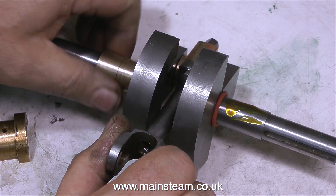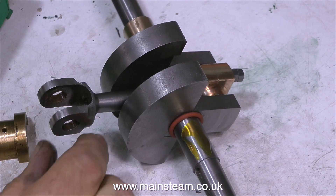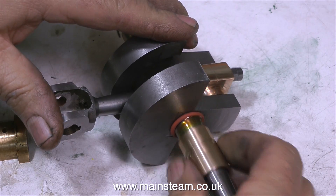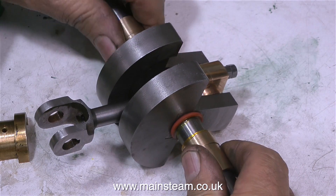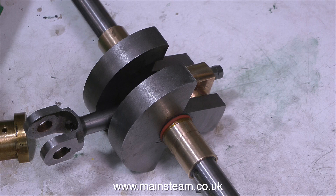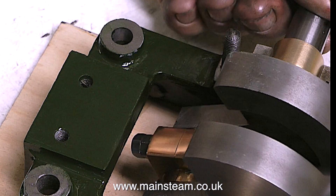I'm just checking the fit of these bushes on the crankshaft journal before I put it all back together. The bush is not a tight fit and it's not a slack fit. It's more of a fit that you would get with an internal combustion engine. A lot of the steam engines I work on, most of the bearing surfaces seem to be a bit of a rattle fit. As this engine was originally very well made, and bodged by one or two of the owners perhaps, I decided that I was going to rebuild it to a very good standard.